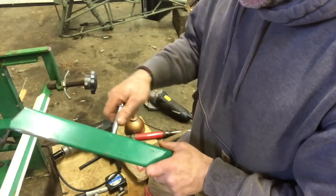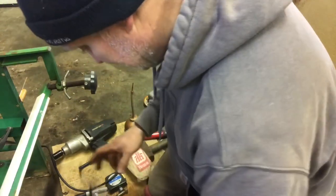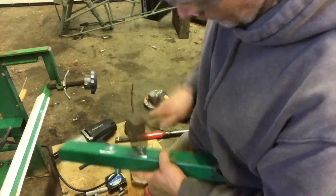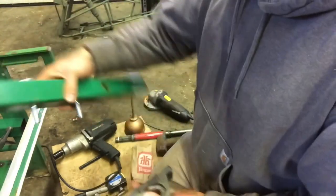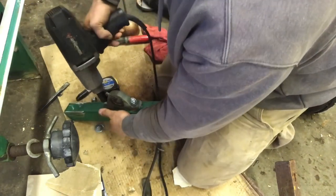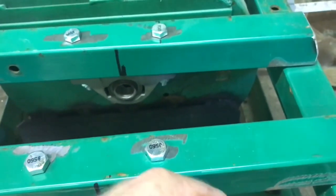So, I got 1/2 inch bolts. And 1/2 inch bolts fit tightly into 1/2 inch drilled holes. So we're gonna tap them in, which kinda works, because it kinda keeps them in there somewhat permanently. We're going like this, we're gonna put our bearing in. Put this in here. Seems like I don't have a lock collar for the other bearing, so I'm gonna have to see if I can get one.